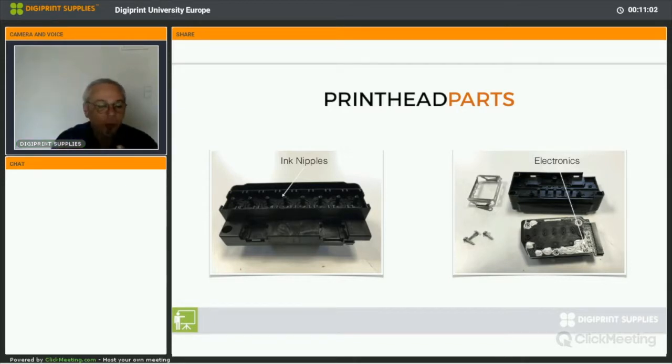The piezo elements in an Epson DX printhead are not of the same sturdy quality as in industrial printheads. The manifold from a DX5 opened up shows a rubber gasket with eight connections where ink enters the printhead. The only reason Epson heads were so popular is that you could have a full CMYK printer with just one printhead — or two in the case of the DX4 — whereas other printheads required at least four for CMYK. They were cheap and cheerful. That gasket is the only protection against ink or cleaning liquid touching the electronics, and it's not precision-engineered, so sooner or later it starts to cause problems.